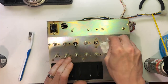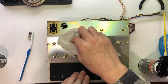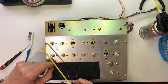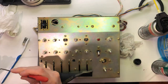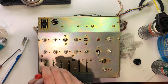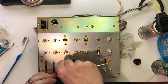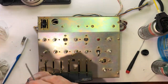After spraying the faders with DeoxIT, the existing damping grease ended up getting removed, which is typical. So I used the same Molykote grease on the sliding surfaces on the inside of the faders. The right way would have been to completely disassemble each fader, but clearly I'm a slacker, so I managed to finagle the grease in there without taking anything apart further or getting grease down on the carbon tracks.